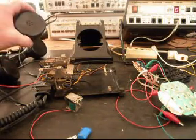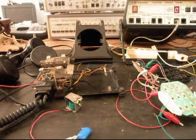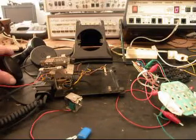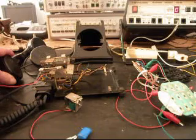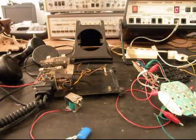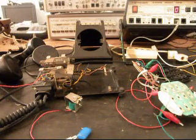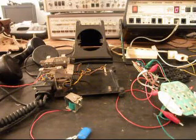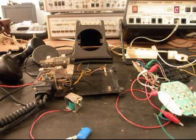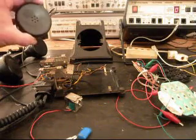And really what this came down to is why they have two receivers is because of the reception sometimes in the foreign country. Maybe the reception wasn't real good, and you could put the handset up to you and talk in it, and then if the room was noisy or the reception was bad, you could go for the mother-in-law receiver and put it on like headphones, so you could have one ear with the mother-in-law capsule, and then your handset, and it was almost like wearing a set of headphones and you could hear better. And so whether the room was noisy or whether there was bad reception, that's basically how they came to be, what they called the mother-in-law receivers.